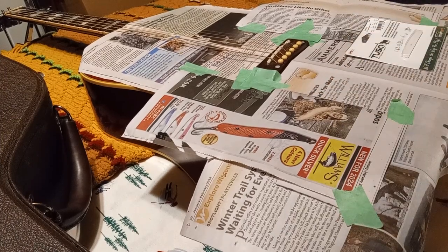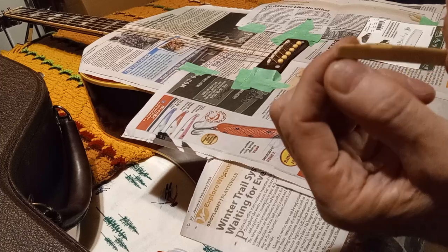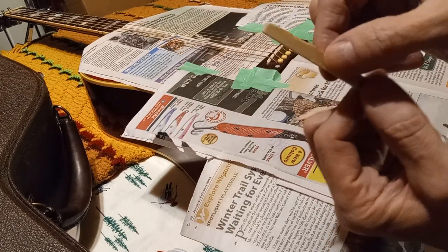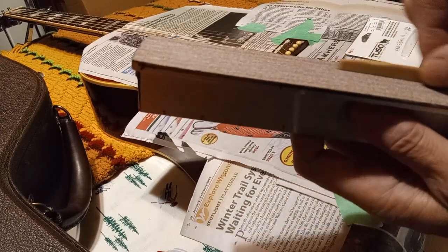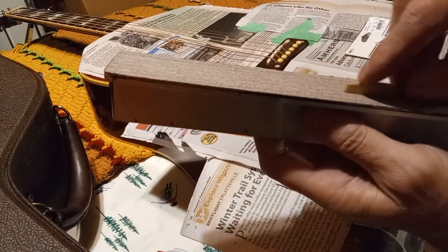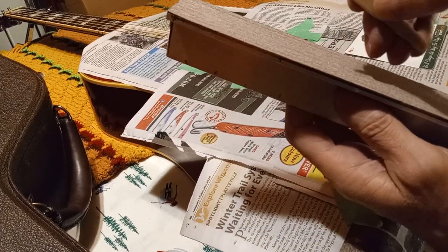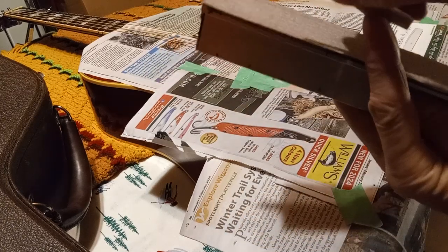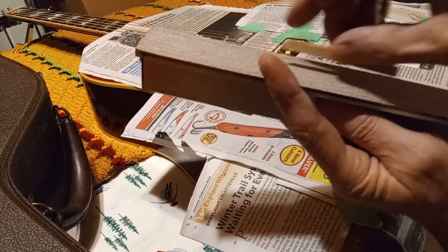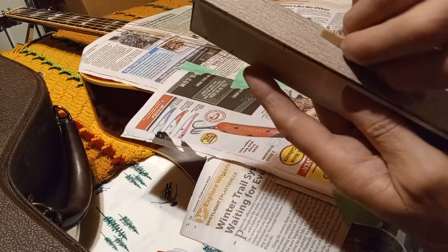Keep it all even - do both sides. I'll take a pencil and draw a line where I'm going to start with my height - use a straight edge and do a pencil line. Apply even pressure in the middle and on the ends, counting all your strokes. You can go in circles or back and forth - I like back and forth, but you've got to turn it around too. You'll see on your line that when going forward it cuts more than on the back pull, even with even pressure, so turning it around evens that out.